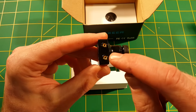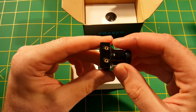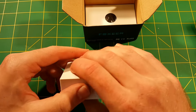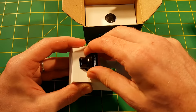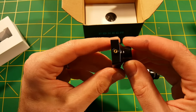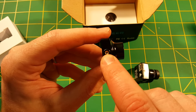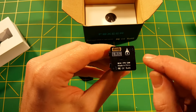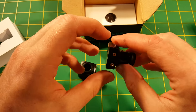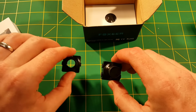You'll also notice this has two screw holes, which are for the different mount version that comes with this. But if you want to mount this new camera into a traditional HS1177 mount, or if you have a frame that already has side plates for mounting an HS1177, the camera comes with this additional frame. This little frame case has the standard center screw mount for HS1177-style mounting brackets. You will have to remove the two screws, remove the lens, pull the electronics out of the case and remount them inside this additional case in order to do that.